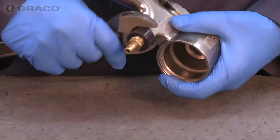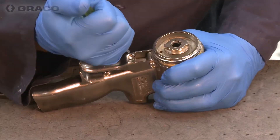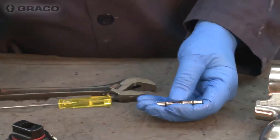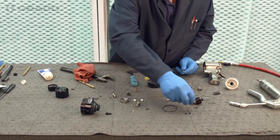All that's left is the air input. We have a spring, and there's a cutaway in the handle here to press back the air spool. The air spool has three small O-rings. Be careful when you take these off that you don't scratch the spool, or we'll leak air.